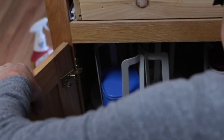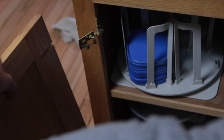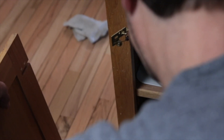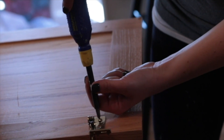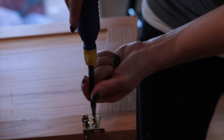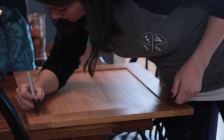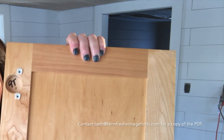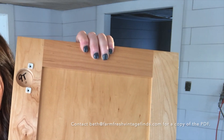There are several different kinds of hinges used for cabinetry. The one in this kitchen has two screws that hold it to the door. You want to remove the entire hinge from the door and all of the screws. We usually have two plastic bags — one for door screws and one for cabinet box screws. You will need these screws to put the doors back on, so do not lose them. Using a Sharpie, label each door with the box that it came from. Refer to the PDF document that came with this video for recommendations on how to keep track of which cabinets are which.